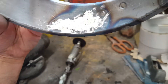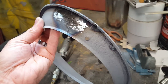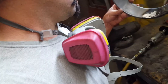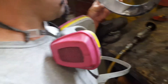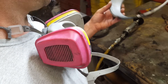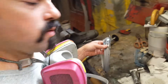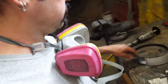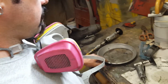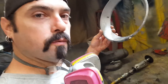If you don't want to heat this up anymore, you don't want to braze it — that's too hot. What I'm going to do is get it down as flush as I can with the sander, and maybe fill this in with some silver solder. You just heat that up with the torch and some flux, and that'll get it pretty smooth. That's basically metal on metal, and then you can put a little filler on there, but very minimal.